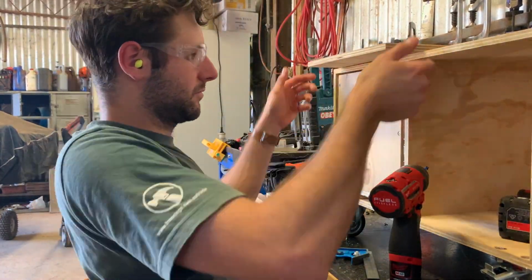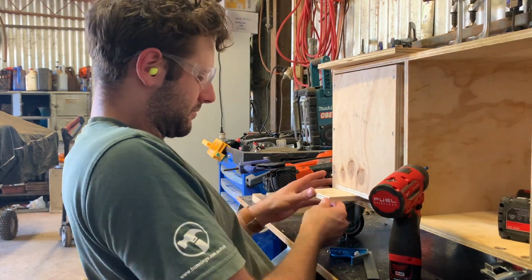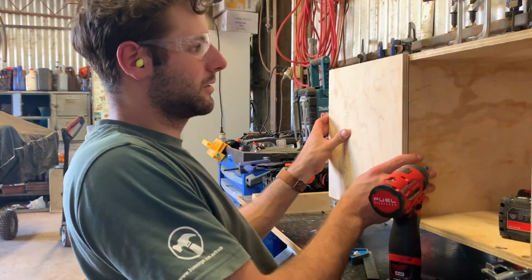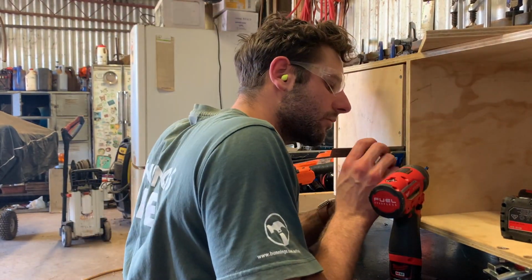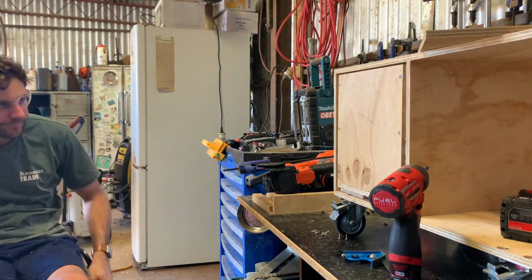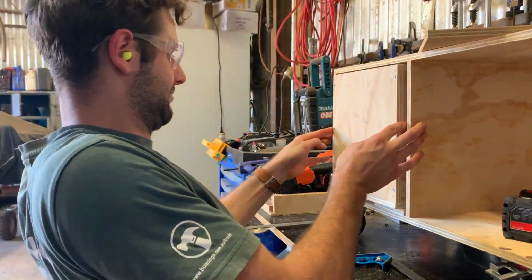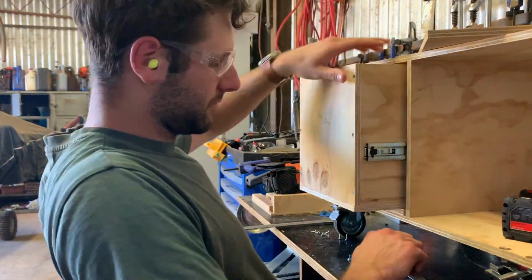And then I got a slide square on each side and measured how far in the front of the drawer slide was, so that when I had to pull the drawer out and line it up, I could use the slide square to set the distance back that the drawer slide had to sit from the front of the drawer.